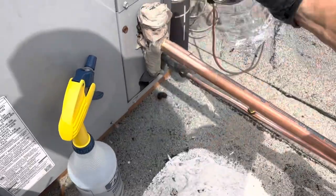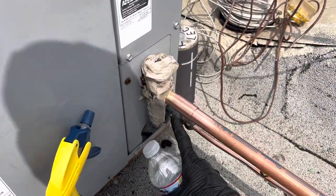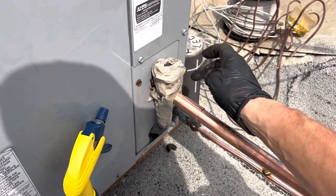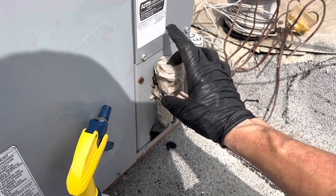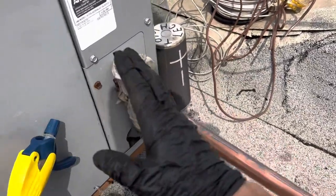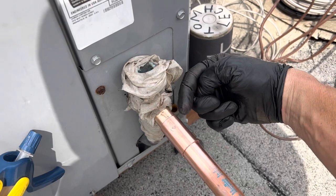Just prior, I dump a little water on here until I have water droplets coming down off of all this stuff. And as long as you can keep liquid water on here, even if you hear a little sizzling, as long as you can keep it with liquid wet water, you're not really exceeding 212 degrees — to keep your temperature away.